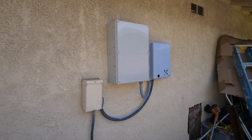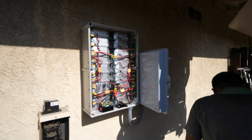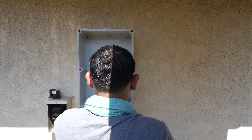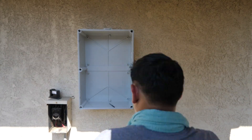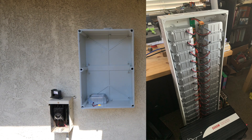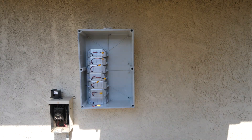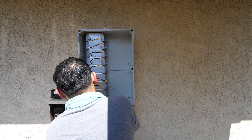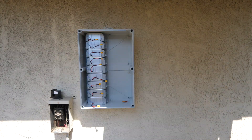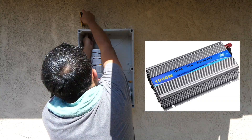Like every other one of my projects, this is ever-evolving and I foresee a lot of tweaking before I get something I'm happy with that works reliably in an autonomous way. One aspect I feel comfortable sharing is the battery box design — it's by far the quickest way to assemble two kilowatt hours of storage using these fireproof hoverboard packs from BatteryHookup.com. These are 9S packs, which gives them a weird voltage of 32 volts, only compatible with these solar grid-tie type inverters, but they're super easy to secure inside watertight enclosures.